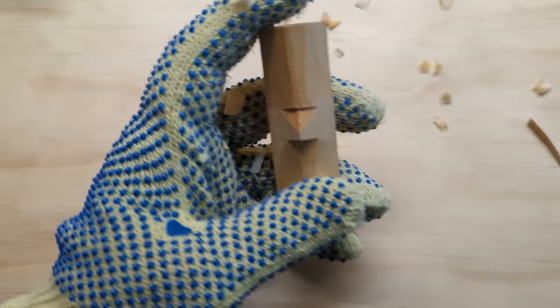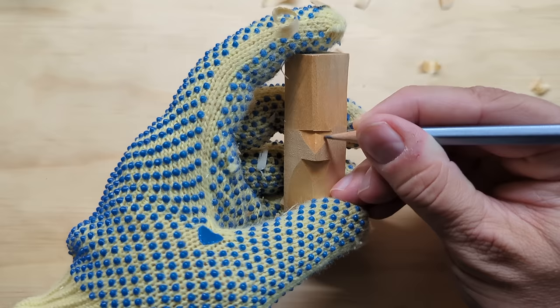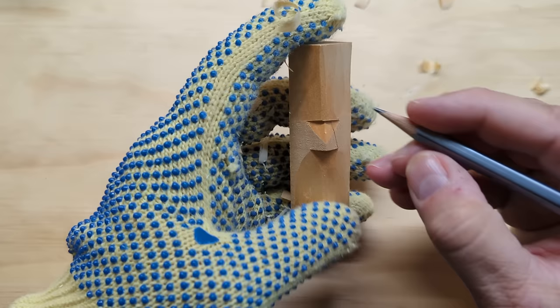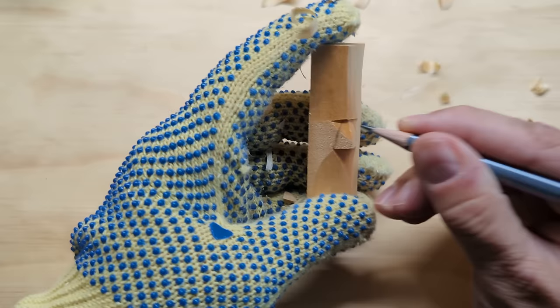next thing we're going to do is try to carve the nose. So I'm going to draw these lines on for you. I'm just going to go a little bit out to the right at the top of the nose, outside the brow. I'm going to draw a straight line down to the outside corner of where I stopped in undercutting the nose. I'm going to do a similar line on the side. So I've got a roughly symmetric kind of trapezoid when viewed from the front for that.